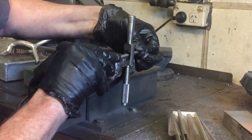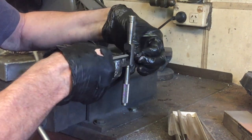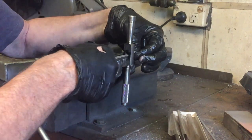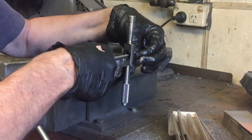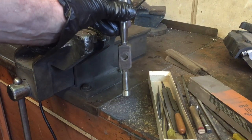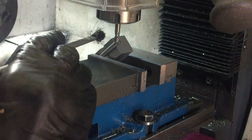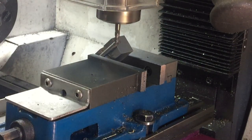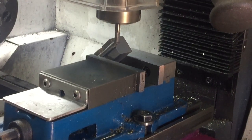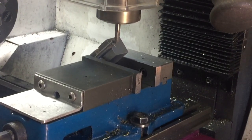This was a very slow process, and in hindsight I really should have taken a lot more effort to get it exactly right. Time to put the V in the moveable shaft, and this all went very easily. The small tungsten end mill cut it quite happily, although I only took very small cuts.